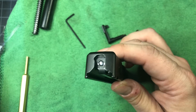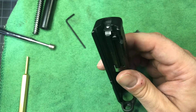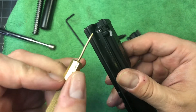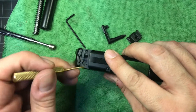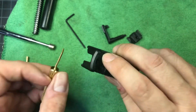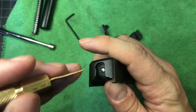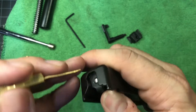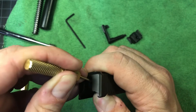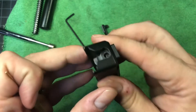Now what we can see is we've got a backing plate back here. A lot of 1911 guys are going to recognize this. Most of the Series 70 and Series 80 just come out through the bottom. We've got our plunger over here, that's our plunger, that's our toggle, and underneath there is the spring. And what we will find is this pin that holds it all together. The backing plate is held captive by the safety.